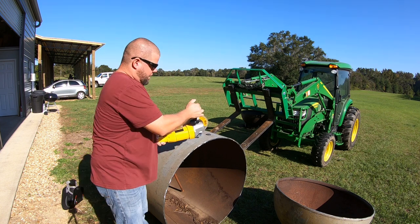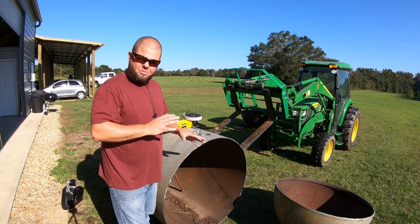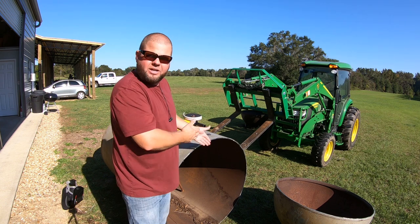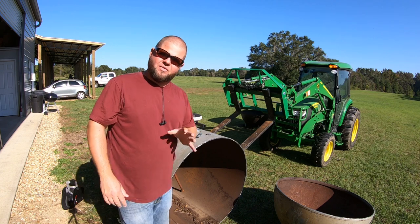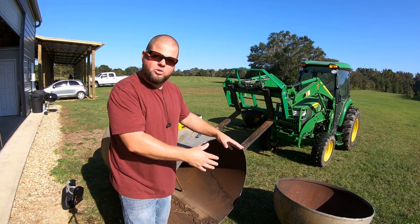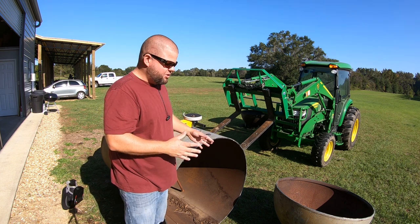So, as I'm making my cuts, I would say I'll probably pinch that blade, including one time that I couldn't even get it out. I had to disassemble the tool on this while the blade stayed stuck in it. I probably pinched it 5 to 6 times. Now, I'll say 5 out of 6 of those times, it was because I was making cuts all the way around and not leaving metal every so often, and this drum was shifting. I was going around with screwdrivers and kind of making wedges to help myself out.